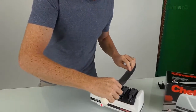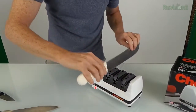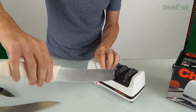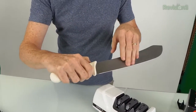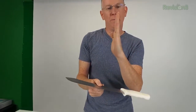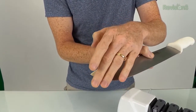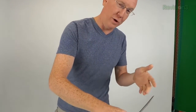I'm going to make about two or three passes on one side. There's a little spinning wheel in there grinding against the blade, so when I feel the opposite side I can feel a little ridge where the metal is bent over — that's called a burr. I'm looking for it to be consistent across the entire edge. In this case I do have a burr running the entire length, so now I'll work on the other side and make three passes there as well.